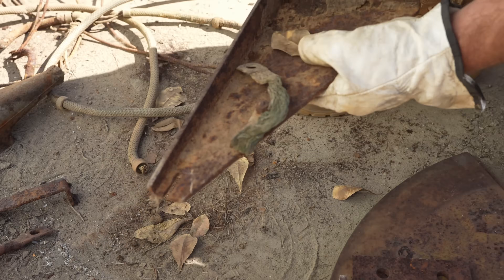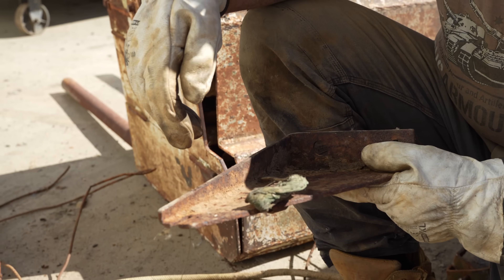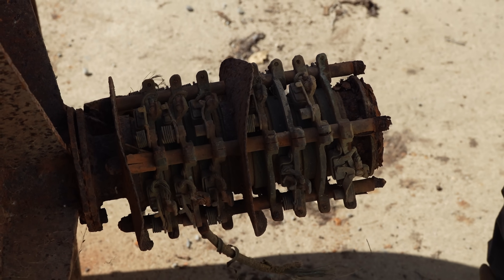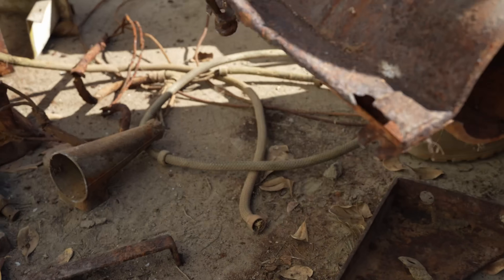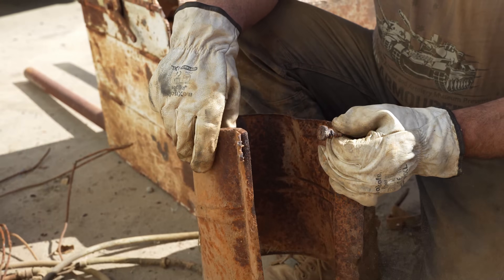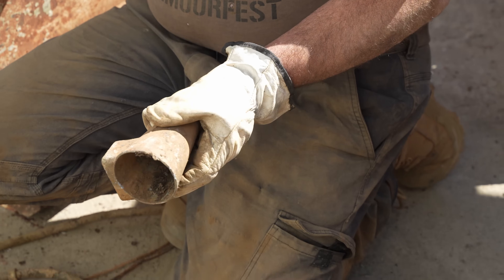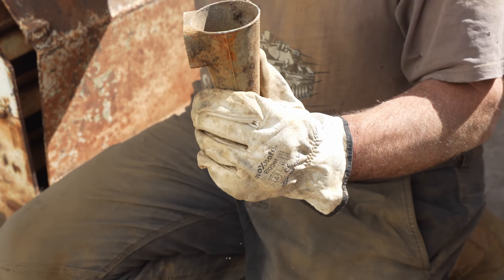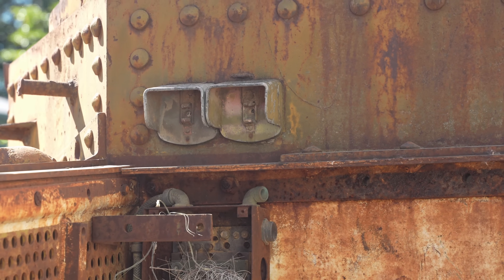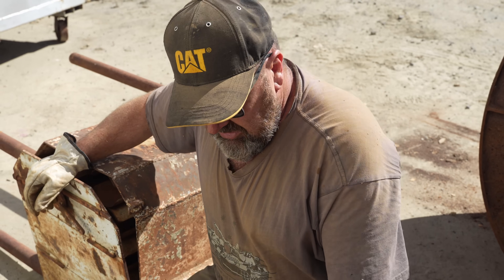This here is the brace to stop the RBJ underneath the turret from turning. The RBJ is a rotary base junction and it provides power to the turret. This is the cover for the RBJ and that encloses all of the electrics. These tanks are also fitted out with a fire extinguisher system — you can pull handles for the outside and these nozzles are directed at the engine in appropriate places to put fires out.